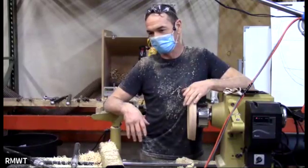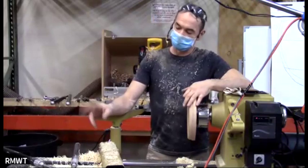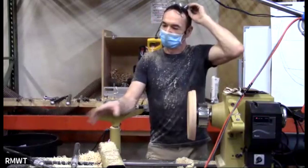You can see using a combination of 40-40 gouge, negative rake, bottom bowl gouge, that's the result I get. So I don't deal with torn grain. There's still a skill level to learn with a 40-40.